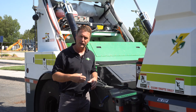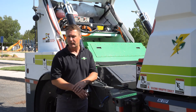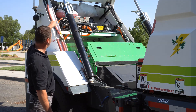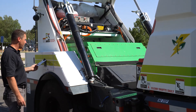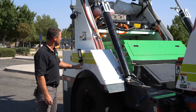Tests that we're running in New York City right now are actually showing that on a full day of sweeping in New York City, they're coming back and still have roughly 40 to 50% battery life at the end of the day. Right here on the fender is actually where we're going to plug in and charge with our J1772 — that's where your plug is going to end up going.